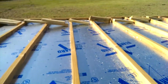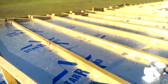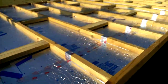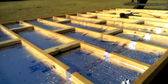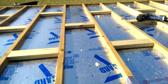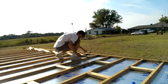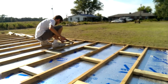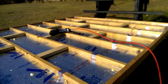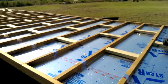Up here we're putting some braces in between the 2x4s so that there's no rotation of the 2x4. I didn't think there was going to be, but it is recommended. We're just laying them in flat. David is hammering them all into place, and we're putting them a little bit below flush because they're not actually supporting the subfloor — they're just keeping all the beams from moving. About 45 pieces at 14-and-a-half inches, then coming back with a nailer and shooting them into place.